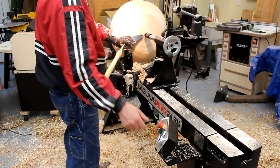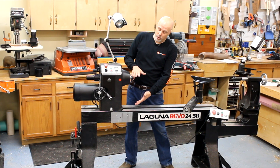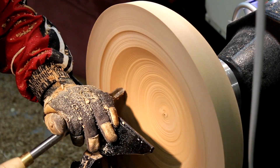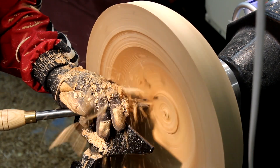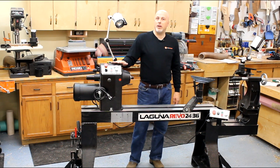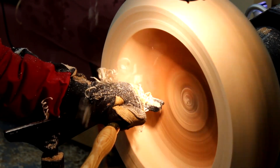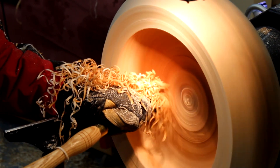Starting with the obvious difference — the additional capacity. The swing capacity starts with 12 inches between the center of the spindle and the lathe bed, multiplied by two, giving you the ability to turn an object up to 24 inches — a big, big hunk of wood. With that much additional mass, you want more power, and the 2436 comes with a three horsepower motor, which is 50% more power than the 1836. I've turned eight large bowls in the 17 to 21 inch range over the last two weeks and could really feel the difference. That additional power really comes into play at the edge of a massive bowl taking a heavy cut — the variable frequency drive responds, delivers that additional power, and keeps you spinning without bogging down.